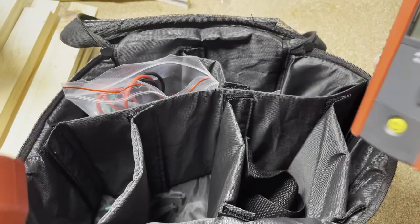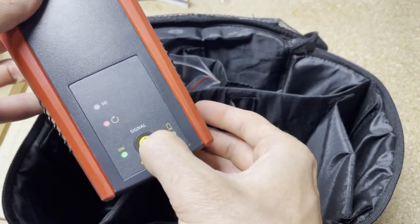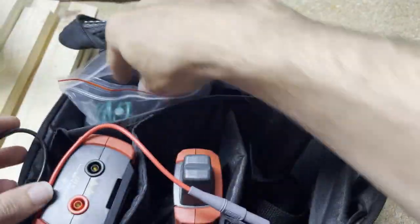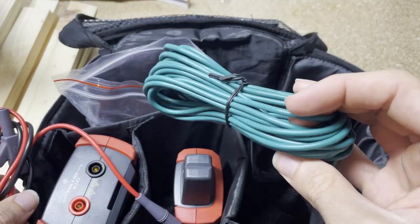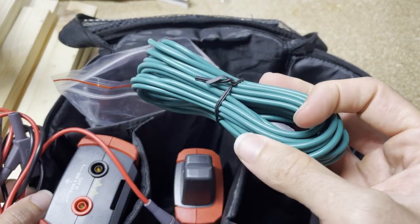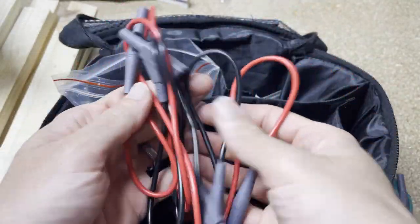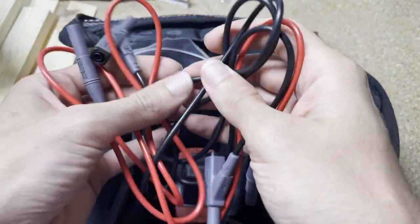Let's look at the other things that come with the kit. You get a long green cord used for connecting your earth ground. What's recommended is finding a separate ground from the one traveling through the same outlet or light fixture you're working on — clip to an I-beam or something with the alligator clips. That gives you a stronger signal and won't cancel it out. But in my demo I actually just used the neutral and the hot, and it works.